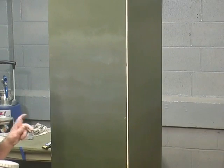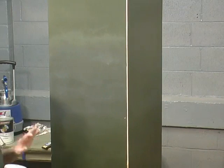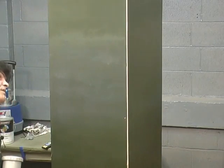Now again, if that was the first coat and I had a stain under it, I'd have pulled that run real easy. I might have even been tempted just to leave it and get another coat or two on top of it before I tried to sand it back, just so I didn't cut through anywhere. Oh well, that's finishing.